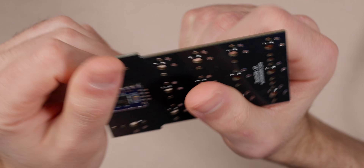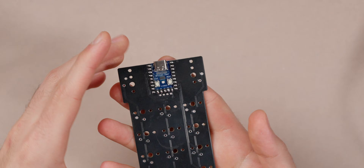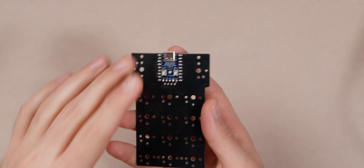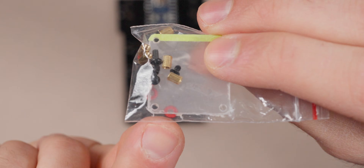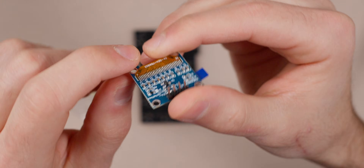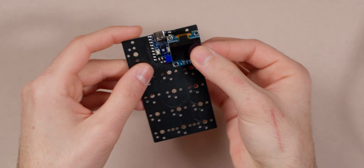There's the controller all mounted to the PCB. This is the backside with the castellated pads, and I reflowed them on the front side to get a good connection. What we want to do next is the OLED. You're going to see there are four pads here on the front of the PCB — the front is the side with no diodes. Before soldering it on, it's crucial to first attach the hardware that comes with the PCB kit: 4mm standoffs, the plexiglass cover, and a longer and shorter screw. The shorter screw, the red washer, and the standoff attach to the OLED first — flip it over, put the screw through, add the washer, and attach the standoff. The reason is there's no way to access the back of the OLED once it's soldered on, so you must do this first. Ask me how I know — I've had to desolder it a few times. Then solder the OLED on, and afterwards we can talk about the switches.